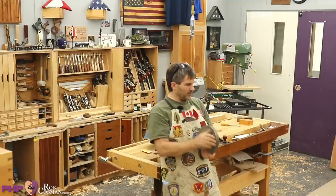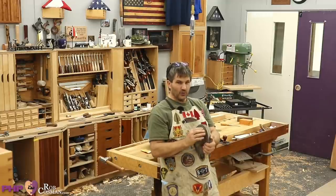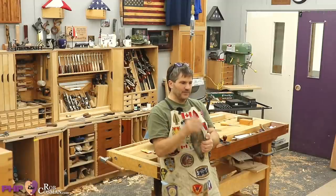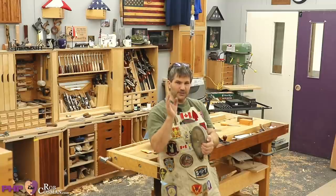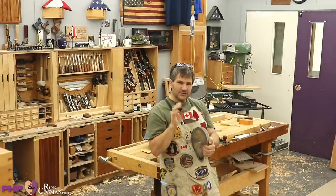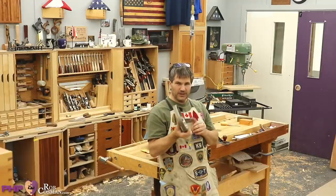Now, Jake went to work with the company that makes these. What did we go? We went to 80 grit or 60? 80. Okay, the ones that were being offered were 120. So we went to 80. You got to remember, I know you asked about lathe chisels, but when it comes to plane blades and chisels, the primary bevel never touches the wood. The primary bevel is merely an angle that makes it easier to access and process the very leading edge. So the surface quality of the primary bevel is not an issue. The faster you can grind it, the better. So I don't worry about this being 80 grit.